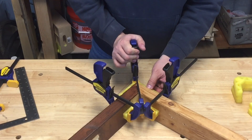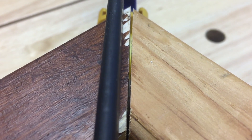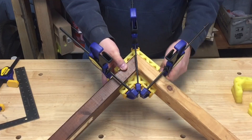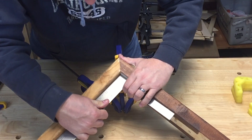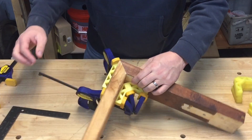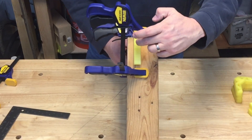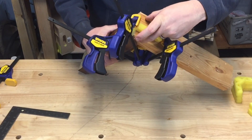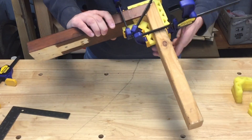I designed the inner one to accept the clamp right there. So I just slide this guy in — I don't want to tighten it too tight. As I pull this in, it pulls those guys together. The gap is all pulled together tight. I have a nice flush surface and, best of all, I have a perfectly square corner.